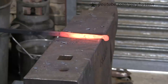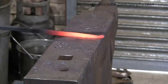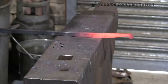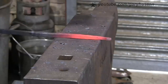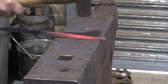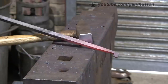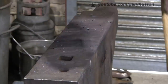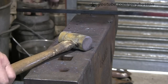I'm just tapering it down - I want roughly, and this is all out of thin air, I'm aiming for roughly eight inches of modified steel. I want it about five eighth by three eighth at the fattest end, tapering down to something like five sixteenths, maybe even a quarter, where the little round bit is.